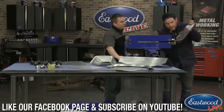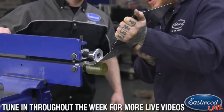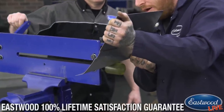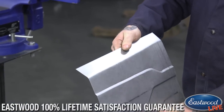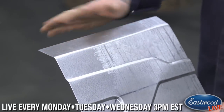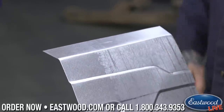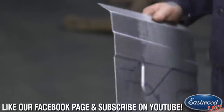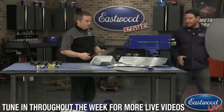I free-handed a line and we'll just roll this through. The top die is going to dictate the shape of the rolled edge. If we use the sharper one we're going to get a nice sharp radius, and each time you're going to push up a little more as you go, rolling it around that top wheel. This one produces a nice rounded line. If you wanted a sharp line, you could use the die that's more squared off and narrow — that gives you more of a broken edge like a normal brake, but versus a brake, you can do something where the line is curved.